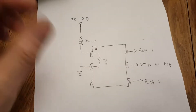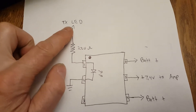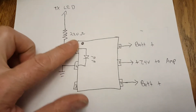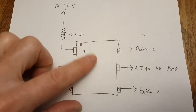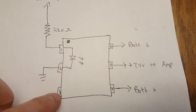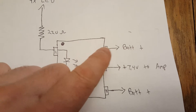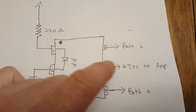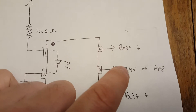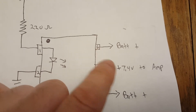Here's the wiring diagram for the solid-state switch — part numbers are in the description. The LED driver signal, which I show on the circuit board in the video, solders to a 220-ohm resistor that drives the internal LED on the solid-state relay. Pin two goes to ground, pin three just break it off, and pins four and six go to battery plus. Pin five lifts up and goes to a thin wire — the regular power wire is a little too heavy — and that goes to the amplifier, then this gets potted down with welder cement.